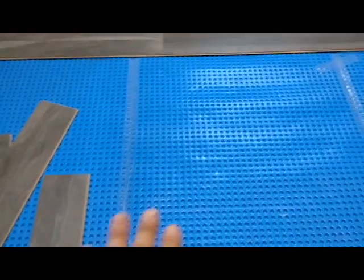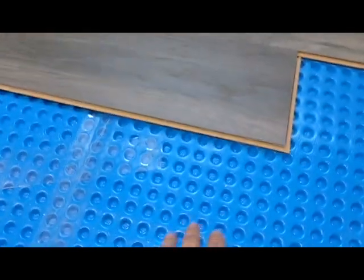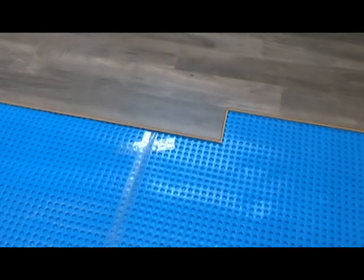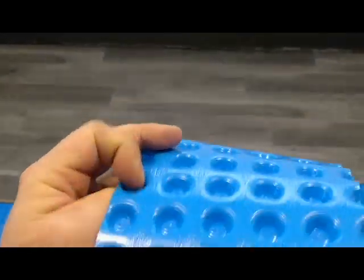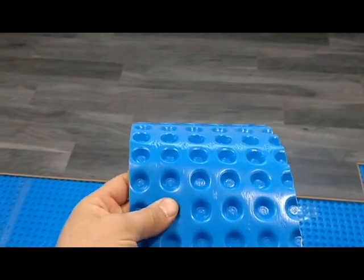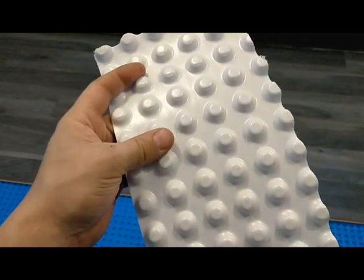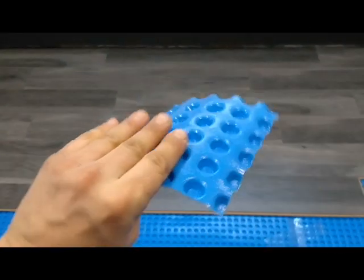You can use it over flat level concrete and then put your laminate of 8 millimeter or thicker — this is 12mm — right on top of it. The top is plastic, super strong, and the bottom is foam which helps absorb sound and adds an R-value. That sits on your concrete and your laminate goes right on top.